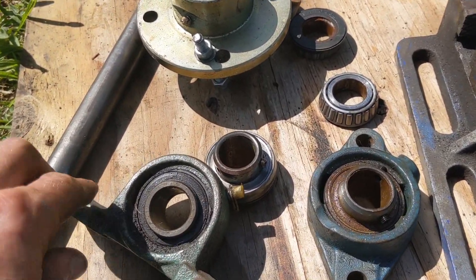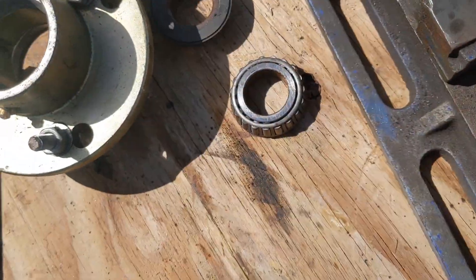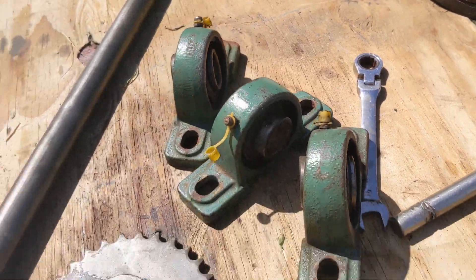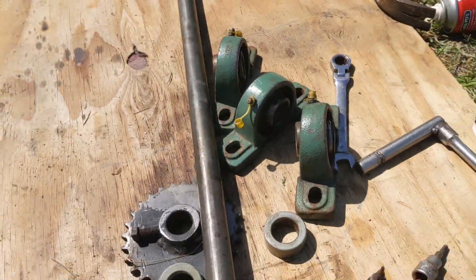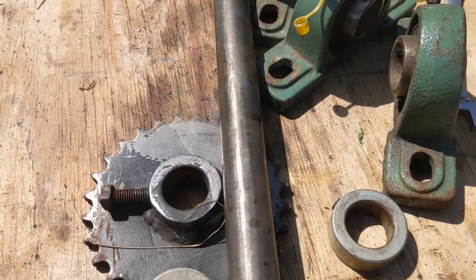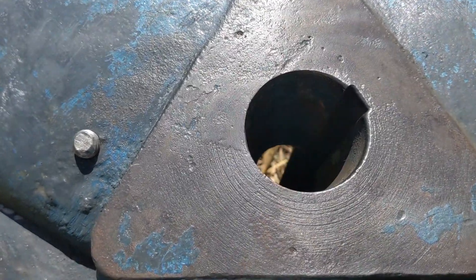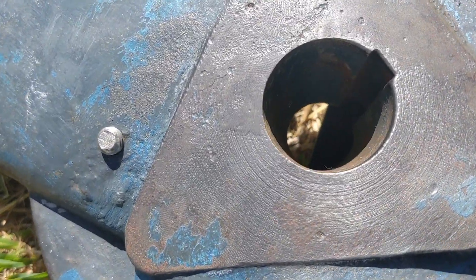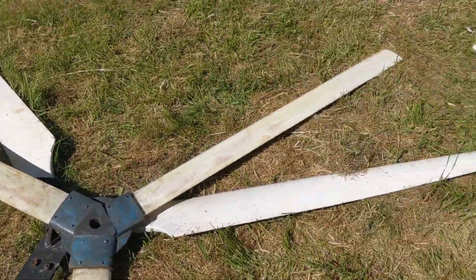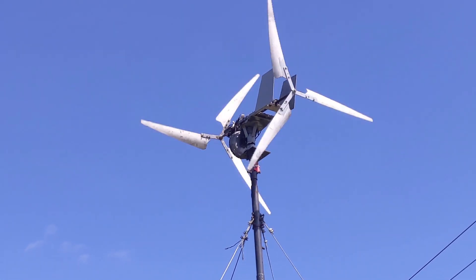So this is the lot. Some of these older bearings — I think these two are one inch and the rest is 25 mil. These three bearings are going to hold the shaft in place. There's the shaft — I'm not sure how long it is, I'll get a tape measure in a minute. Why I wanted to salvage this bit is so that if need be I can extend it. Soon the attention will go to the other end and trying to enlarge it to 25 from 24 — remember this side is 27 and the bottom side is 24. It's a bit like a wind turbine graveyard — will they survive a whole winter of random experimentation? Looking pretty good at the minute.